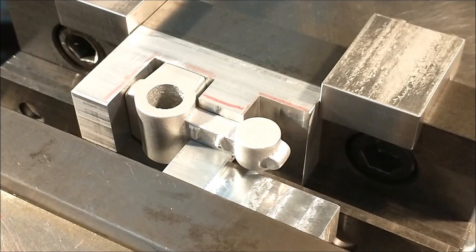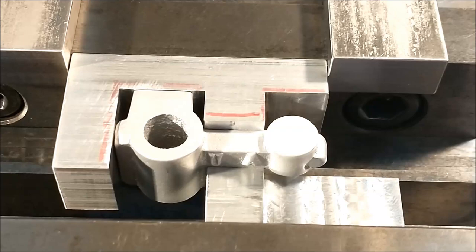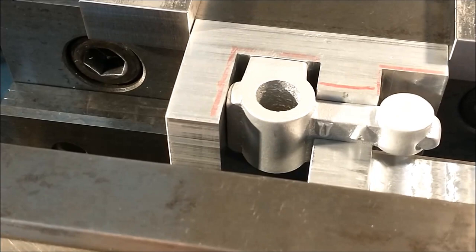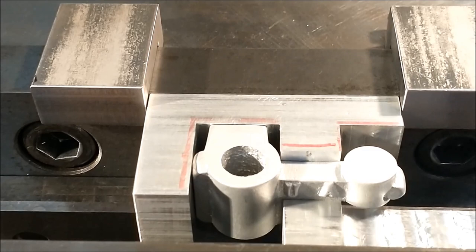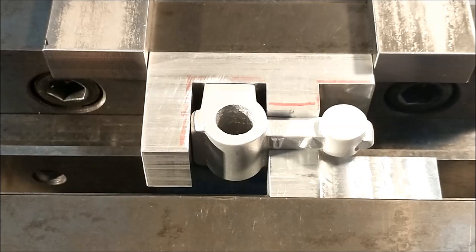The part is now comfortably nested and located in a quick aluminum fixture that I just knocked out, still banking on the center rib locating surface that I established the outer flats from. So rotationally and vertically, it is controlled by the end surface here, touching off on the small flat that I put in while it was held vertically. And it is clamped here. This joint in the back is about five tenths off that surface, so that it is close but not touching. At this time, I can line it up with a pin to the end boss and do these two and the broach that it's calling for, the gear rack. That's next.